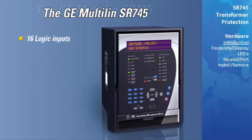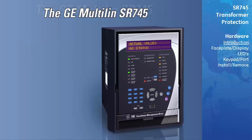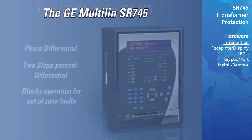16 logic inputs may be configured for different functions, such as remote opening and closing of the breaker, reset, or alarm with a programmable name. The main protection element of the SR745 is the phase differential. The 745 uses a 2-slope percent differential scheme, allowing for sensitive differential protection in zone faults while blocking the operation of the differential element for out-of-zone faults.